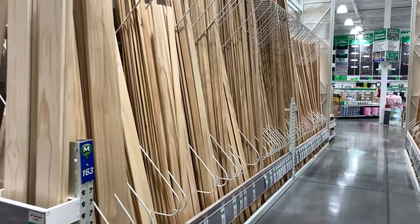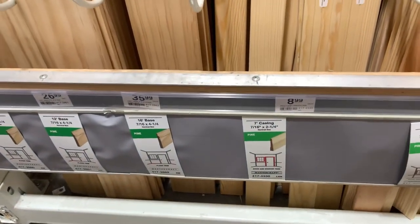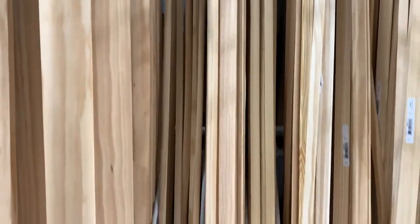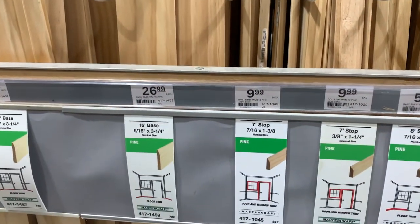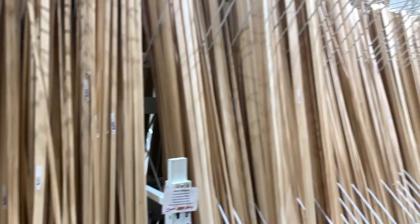I already kind of had in my head an idea what I wanted to do with the closet doors. I just wasn't sure on the wood. I was either going to do a board and batten design or I was going to do the wainscoting design. I decided to go with the wainscoting design. The first thing I had to do was go to my local box store — I went to Menards — and I just started looking around for trim, comparing prices. I ended up going with a seven foot stop in pine. It is three-eighths of an inch thick and one and a quarter inches wide. I really like that it has the straight edge on one side and the bevel look on the other side. You can go with half rounds as they work with the wainscoting design, but I like the thicker beveled edge — I think it gives it a way higher end and overall better look.